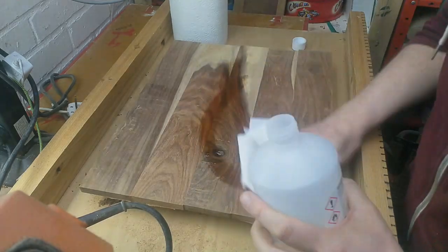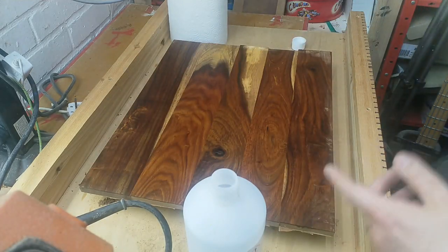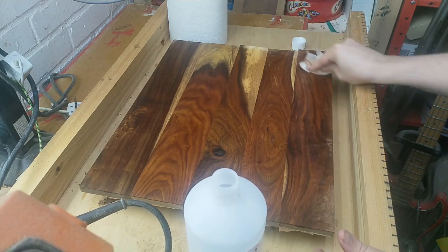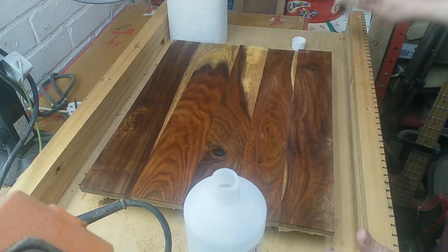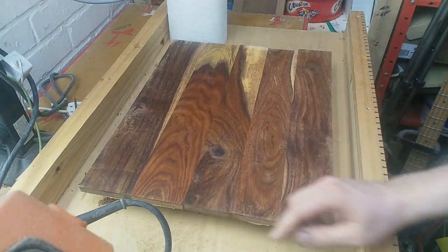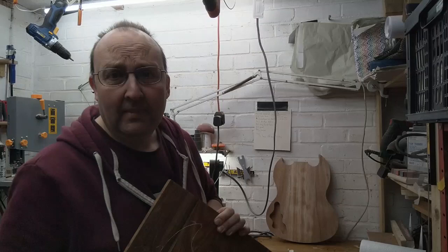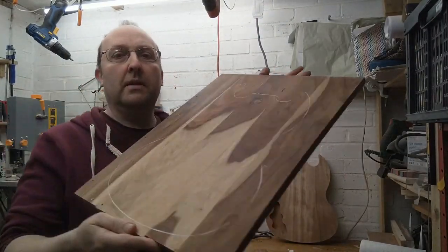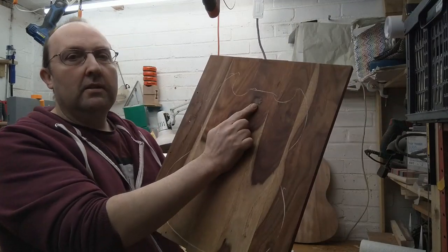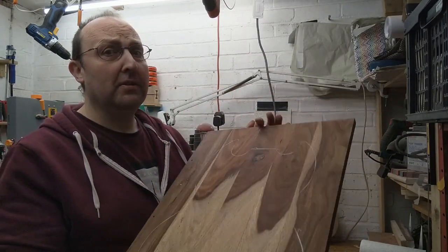Let's see what it looks like anyway. Lovely — that's the underside. I'm just making sure all the dust is gone, ready for the glue. Before gluing it, I want to make it the shape of the SG so I can get the clamps around the edges and squeeze down there. So that's probably enough for one video — we have the top nicely made and levelled, it's going to go on the guitar. But first I need to establish the shape of the guitar and cut this closer to that. Don't panic about this knot, because that's going to completely disappear when we route the neck cavity pocket hole thing. Thanks for watching this far, see you next time.